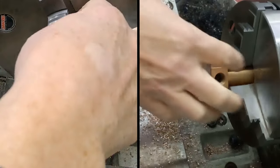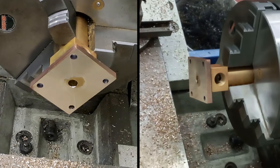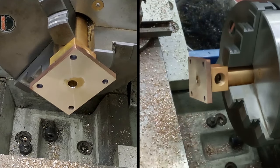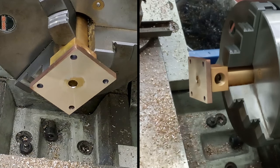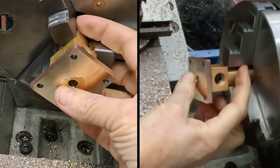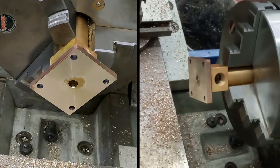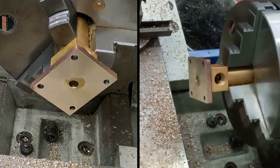I think you could probably hear there was a little bit of a clickety clickety click as we got further down in that. That's as we hit the slots that we've created for the pin that the axle pump yoke rides on. So I'm just taking my time as we break through into all those bits. Hopefully all this first bit of the pump here will act as a guide and keep the drill from wandering. Of course, when we get down to doing the reaming, I'll be going a lot slower on the lathe, in fact. I think I'll slow it down now.